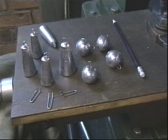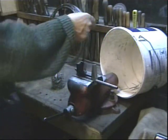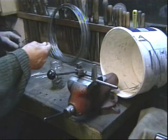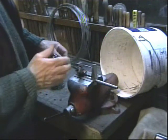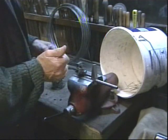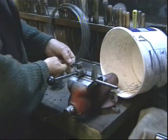I will start with the manufacture of these loops. Over here we have a small guillotine, very simple to use. I buy the wire in 100-metre rolls and the wire is pushed through a hole up to the stop, then the lever pushes smartly forward and hopefully it goes in the bucket. We keep going like this and as you can see, get a rhythm going, and in a very short time you can have several hundred.